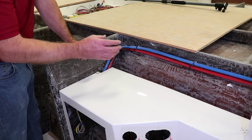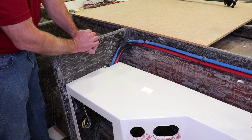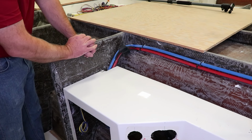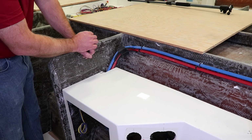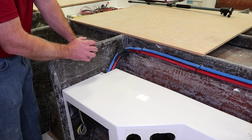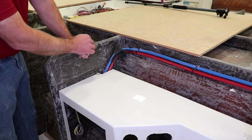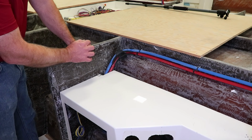Okay, so this is just a quick shot of the PEX plumbing that we put in the boat. You can see the reason we use PEX, it's a polyethylene type material. Can take tremendous pressures, lasts forever, doesn't induce any chemicals into the water. And it runs and bends around where we need it to go. We even use these nice pieces that kind of hold it in the right shape, so it doesn't kink in the bends. And then we use these really high quality PEX fittings when they connect to the plumbing pieces in the boat. But no matter what happens, even if a customer were to forget winterizing his boat and the power went out, if it froze with this kind of plumbing, it wouldn't crack. And that's really important. And then you can see how it's supported beautifully, every 10 or 12 inches, just kind of the way we do things.